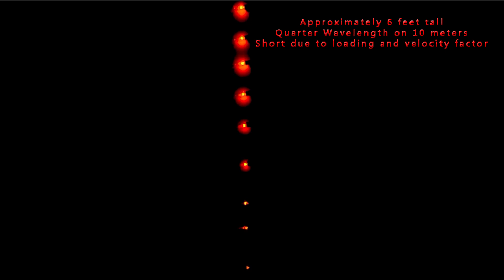It's set up so that the impedance is pretty close to 50 ohms, and I use an antenna tuner. Happy Holidays from Jim W6LG, your YouTube Elmer, here in Rockland, California. So there are the bulbs — the top one really bright, the bottom one barely lit up, barely has any voltage on it. The top clearly has the highest voltage because the bulb is the brightest, and the bottom bulb has the lowest voltage, so it has the least brilliance.